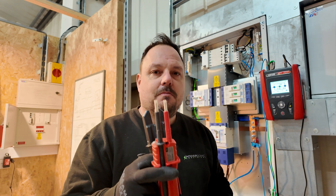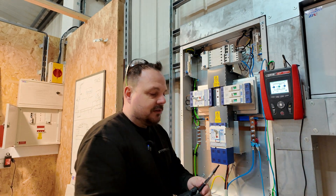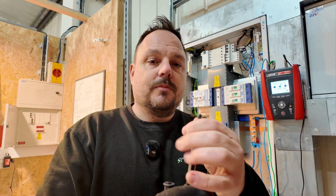These are voltage indicators. As you can see on the end of one, we've got the exposed two-millimetre tips, and these ones have the retractable covers so you're not exposing any extra metal parts in and around the terminals while you're working. You also have finger guards on them as well when we move into the MFT world of things — when carrying out your tests you need to keep your fingers behind those guards. With two-millimetre probes, one wrong slip and you touch something live and you can become part of the path for electrons to flow, which doesn't turn out nice for anyone.